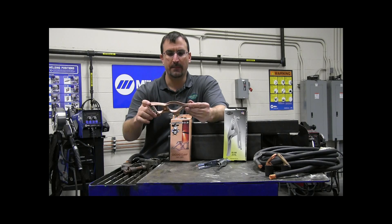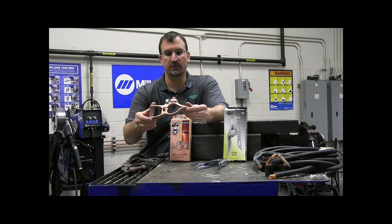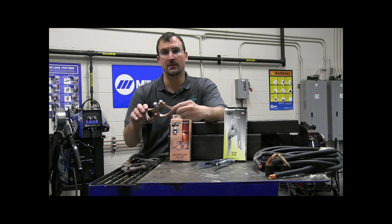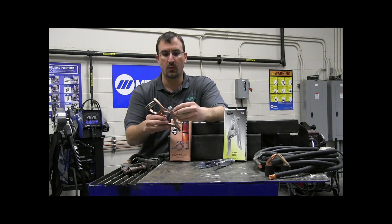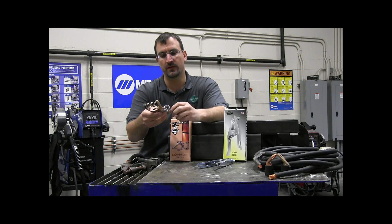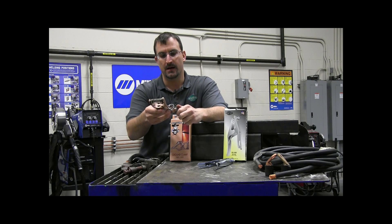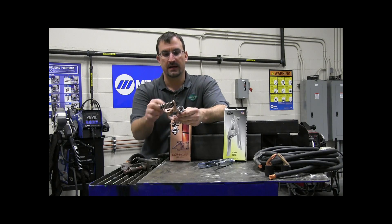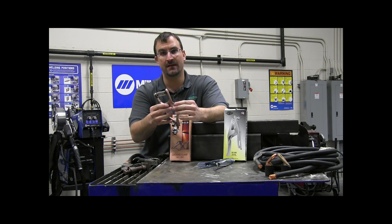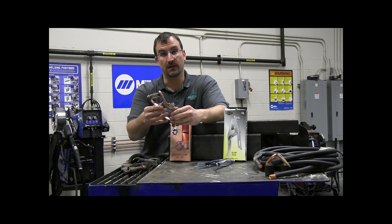This casted copper type work clamp is a little bit more expensive, but I like it more because it's more robust. Also, we can make electrical contact from our weld cable directly to the work clamp through this studded fitting, where you insert the cable after stripping the insulation and then tighten it down. That makes a really good connection, and you can use this band to secure it as a strain relief.